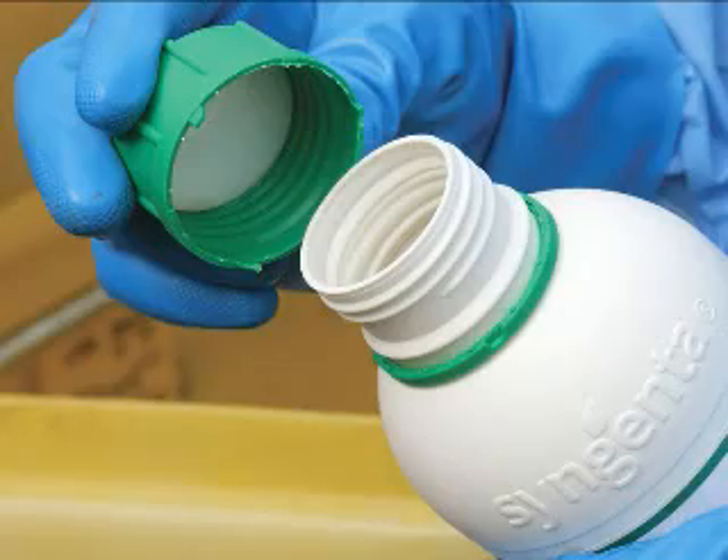How can you speed up filling time when you're in the yard? Most people can get water into the sprayer quite quickly, so it's about how you handle the chemical. The fewer packs you have to open, the better, and having products in 10-litre containers helps. Formulated products mean fewer containers to open, and that will typically save you 10 minutes. Getting rid of foil seals on packs can subtract another five minutes from your typical filling time.